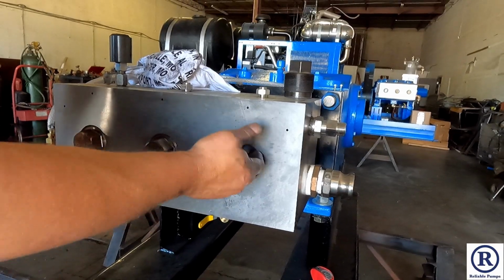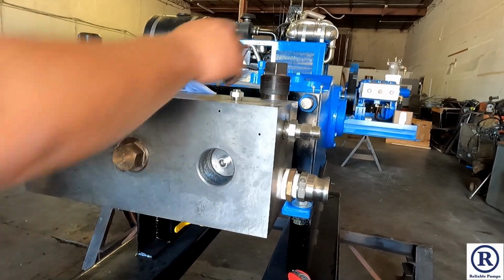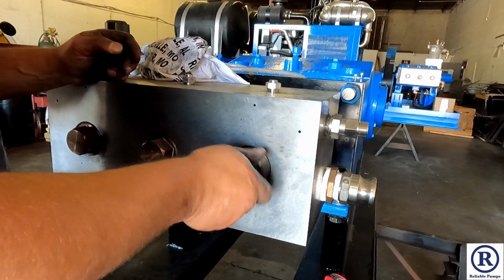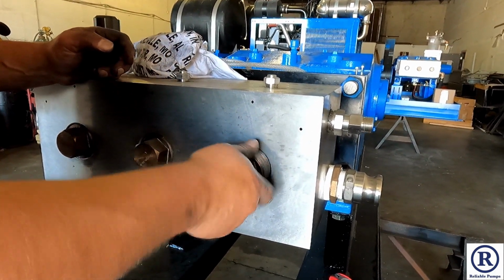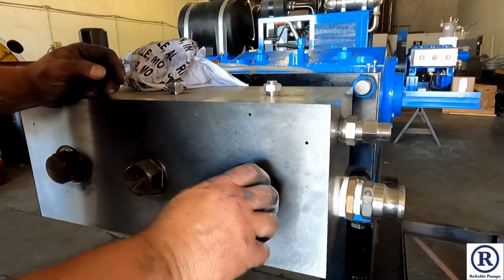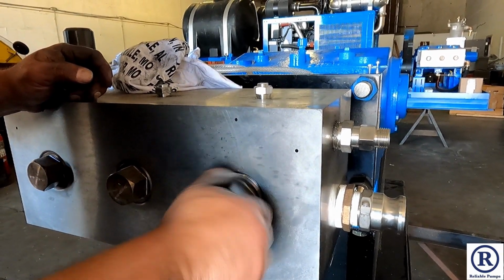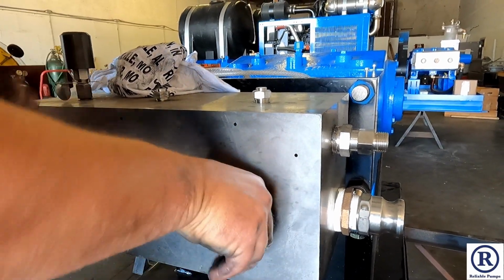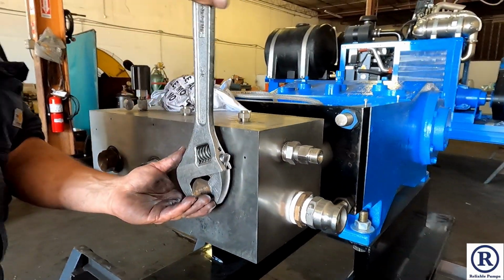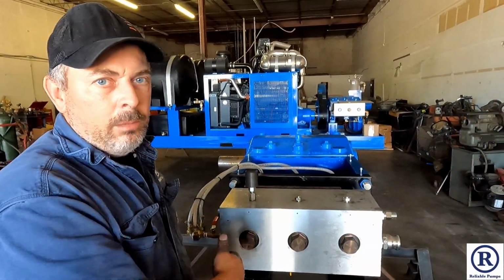If you just need to change the valves, all you do is just take the front apart. You don't have to do that. Your discharge plug needs anti-seize too. If you take your pump apart and there's not enough on there, just go ahead and add some. That's it. All you would do is repeat 2 more times, and you're done.